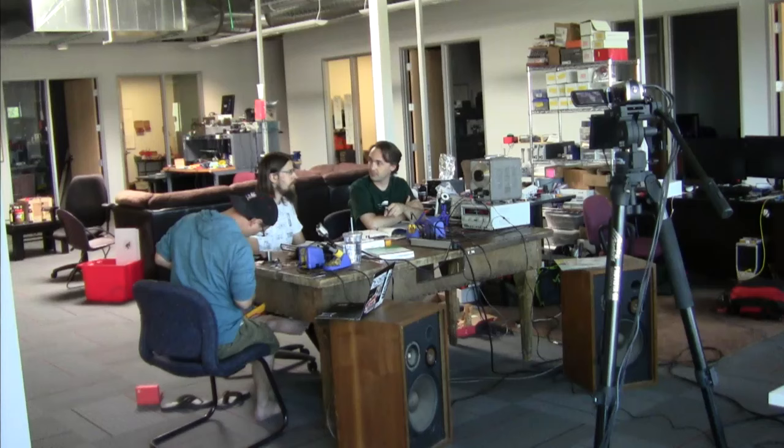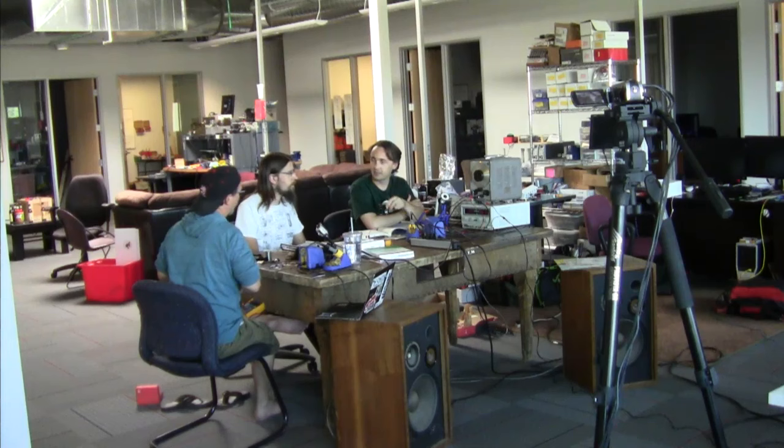That's right, and it's just a hissy, staticky, high-frequency emphasized noise. So to undo that, what they do is boost the high frequencies when they make it. So you get extra high frequency printed into the groove. When you play it back, you turn it back down, and the noise of the groove is relatively reduced as you restore it.